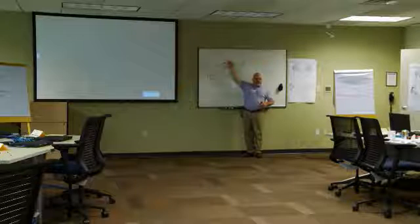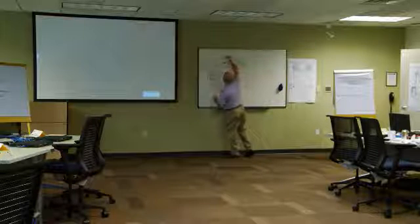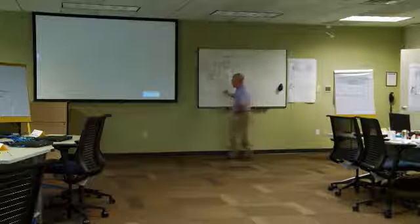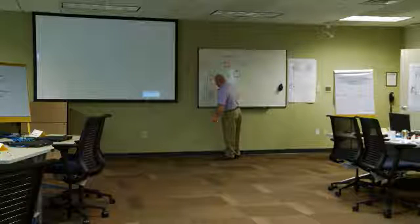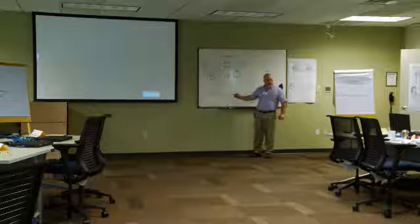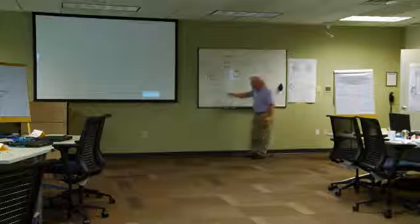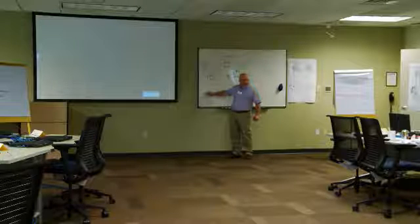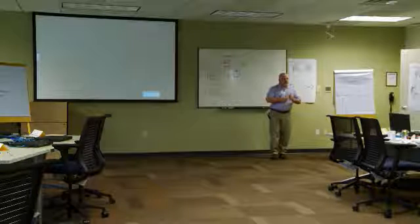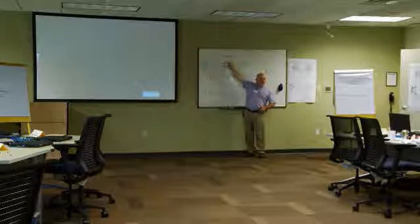This thing could be some protective device, right? Generator, breaker. Most people can relate to breakers. How does a breaker operate? What does it look at? Amperage, okay? We know from electrical theory that amperage, I equals E over R. E being voltage, R resistance. We're not going to do anything with this, but we're going to do something with this. We're going to lessen this resistance. So what happens here? It goes up. Okay? It goes up so high. We do that because we want this to operate as quick as possible. Right?